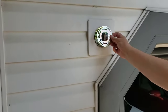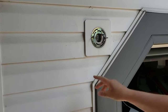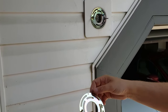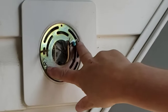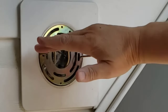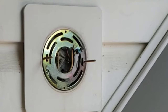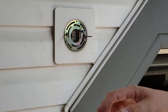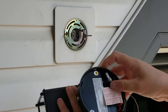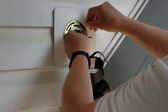I've got the mounting plate that came with the new light, but I already have the identical plate there in the same position, so the new one is just garbage for me. If you don't have one of these plates they're easy to install — just bolt it in here and here into the box, get it level because you want your light to be level, then grab your light and put those two bolts through those two holes.